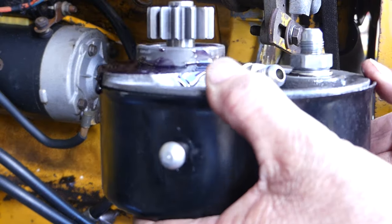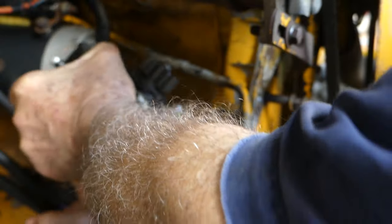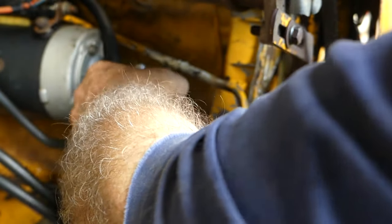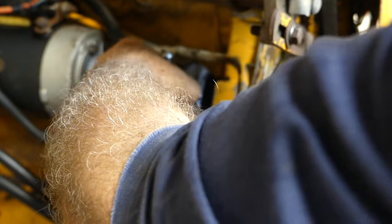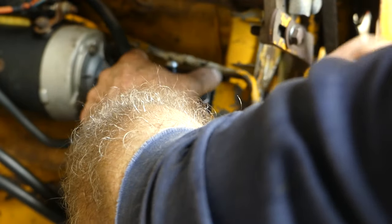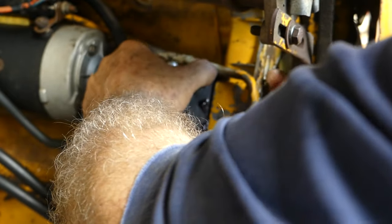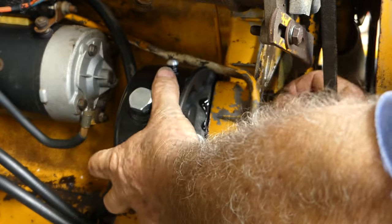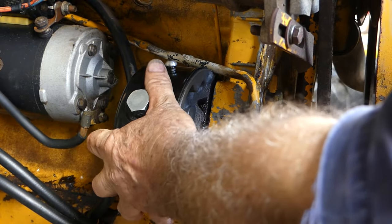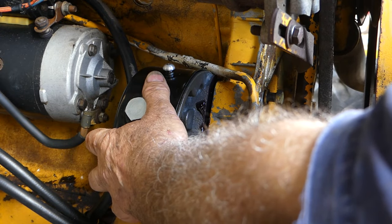I've been up and I've put the fittings in the pump. I did that on the bench and I've decided to use Loctite 515 on the gasket instead of a gasket. So it should be just fine in this situation. I'm quite happy with it. Saved me making the gasket, and this stuff is, well, I rate it. It goes hard when you take the air away from it, and if there's a little bit in there still, there's a little bit there that comes out, it doesn't bead up sort of thing.